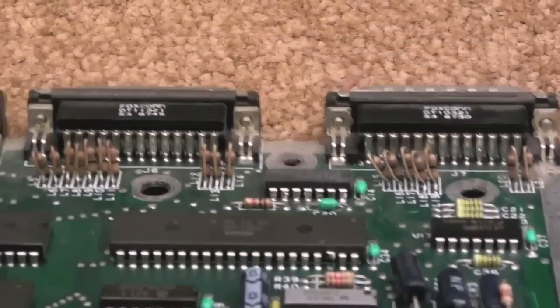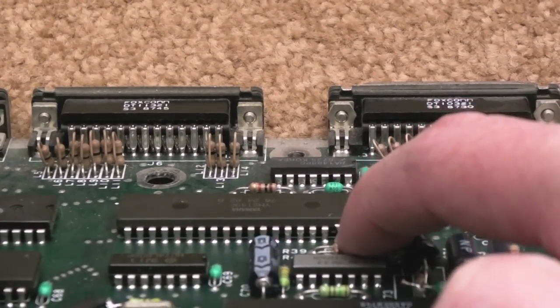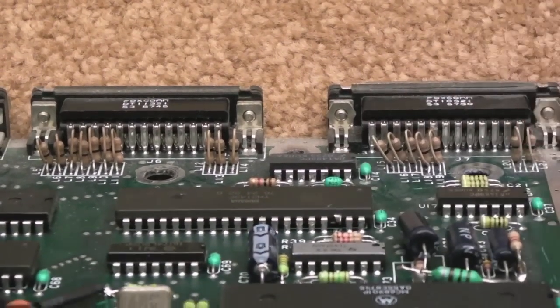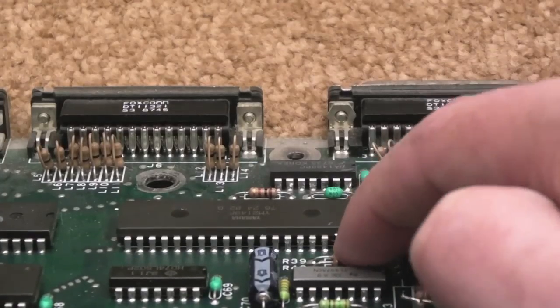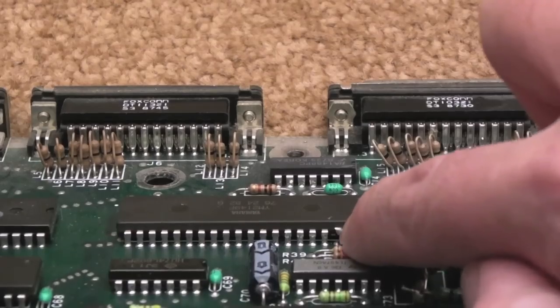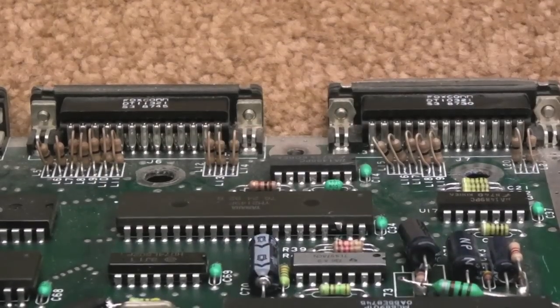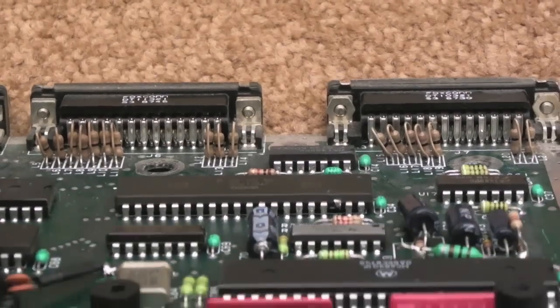I know you can see this. All I've done is I've used some cutters and I've just separated that, just lifted it slightly. So, you know, it doesn't look great, but I can still solder to the point on the board, and I could probably get to it from underneath without a problem. And I can actually solder that pin, and I'll use some heat shrink just to connect a wire to that, and then underneath, I'll just show you.